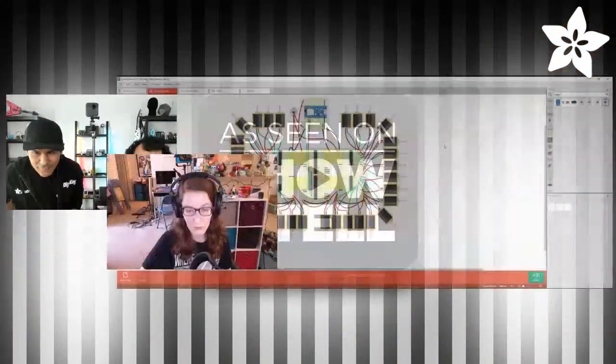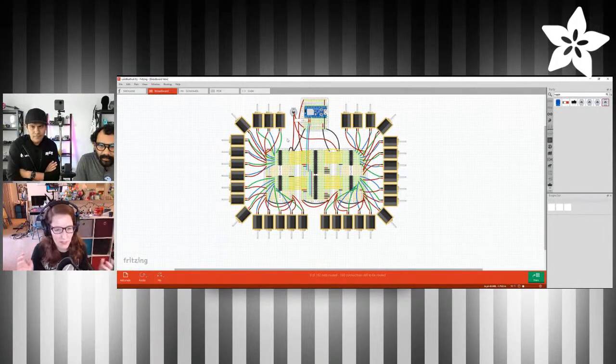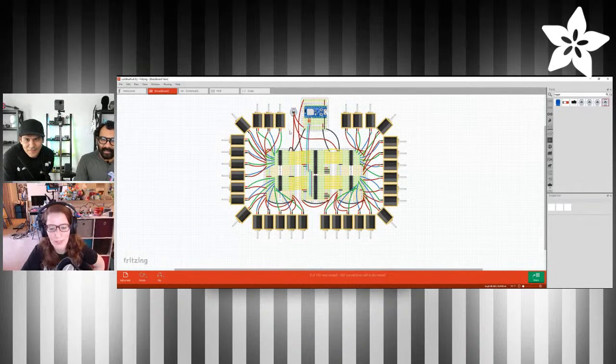Yes, because they're the really tiny ones. So that's why I chose them, because it'd be easier to drive them. And I also threw in a switch here that actually controls the power flow to the Darlington drivers. So if for some reason stuff locked up, or your MIDI went nuts, and as a result your motors went nuts, you can power it off, and it's independent of the code. So you can just shut things down really quick. A good idea. Yeah. So cool.